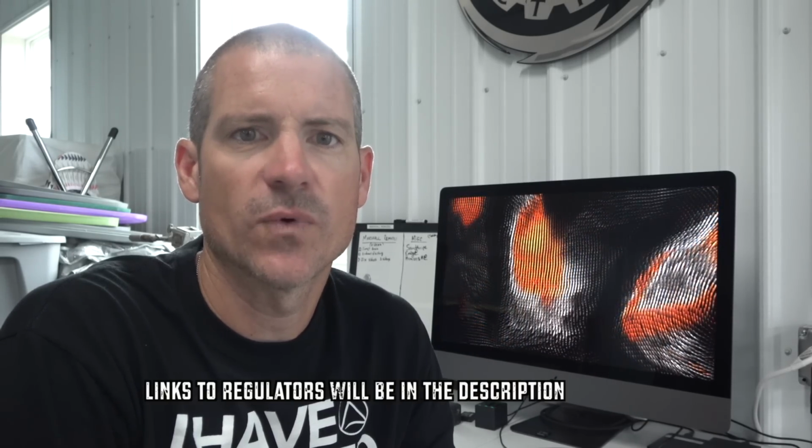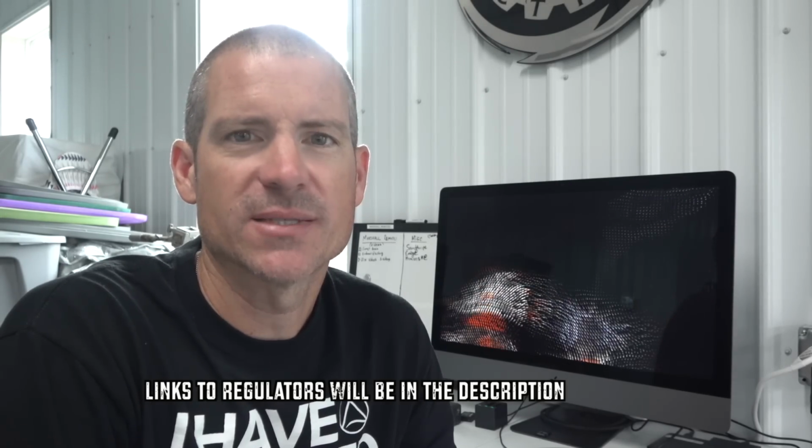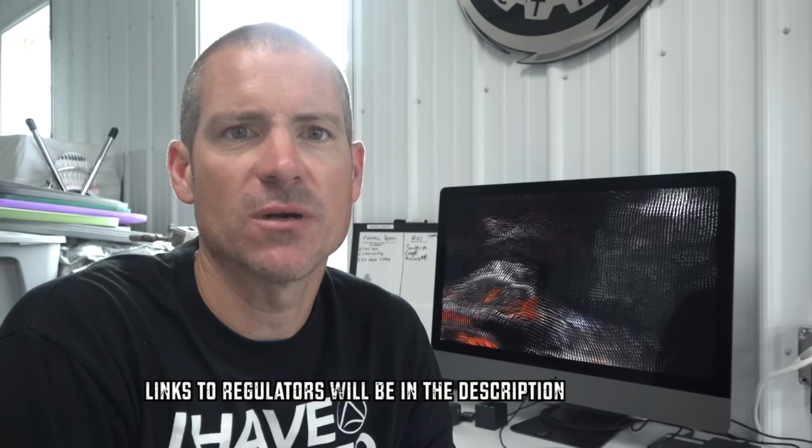Alright, well hopefully this explanation of a 2 psi LP gas system was helpful to somebody. This is not an end-all be-all by any means. You still have to do calculations for the size of line you need to your appliances. However, this pretty much solves your problem of not having enough gas flow in your lines to supply all of your gas-fired appliances at the same time.